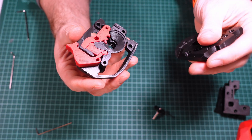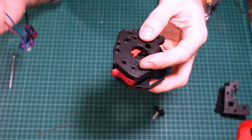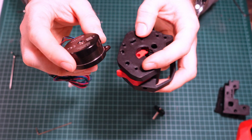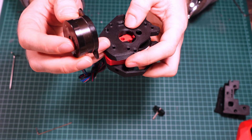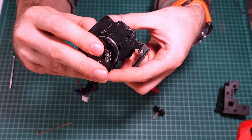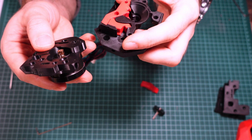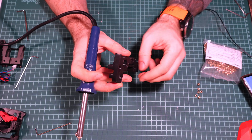There is a big ledge for fixing and unfixing the mechanism, just like in Clockwork 1. It all gets pressed together with the top part. We're looking at NEMA 14 stepper motors — I got one from a well-known supplier, nice guys, very recommended. The motor goes on top of the back plate and just barely touches the plastic. This is a very tight, very low-backlash build, and I really like the new design.